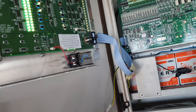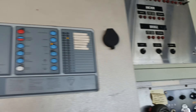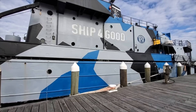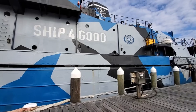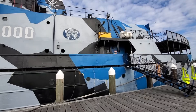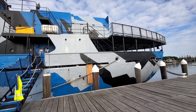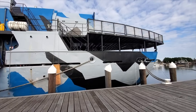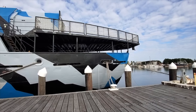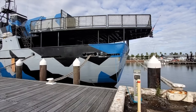That's not finished because we still need that detector to fully commission it. But in other regards we should get some canned smoke to smoke-test the smoke detector ones, get a heat gun to test the heat detector ones, and run around the ship and test them all. Thanks again for tuning in. We've got to get that other detector fitted and then test everything. It's not fully finished, but hopefully it's a bit of an insight into the fire detection system and what we've got to do. The CO2 release system has to be recommissioned properly — the bottles are going to be crack tested and should be returning to the ship at some point. Then the ship is very close to going on its first sea trial in many years, which is very exciting.